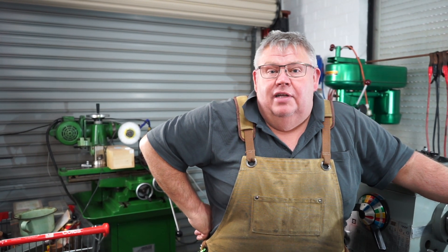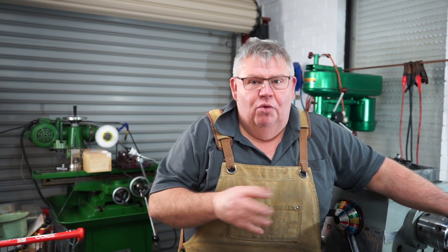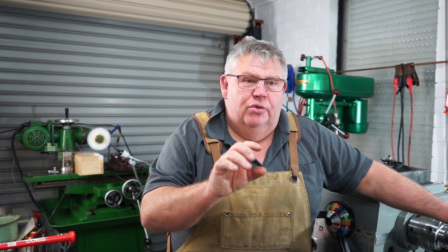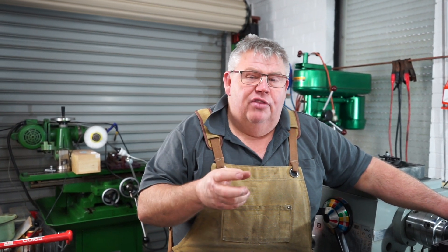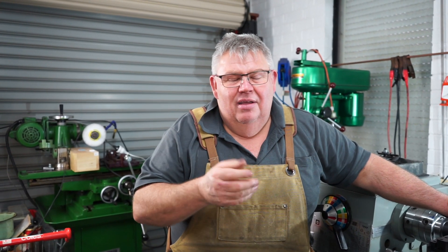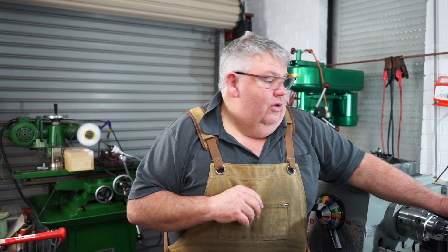Well, there we have it. Thanks for following along today on my Coventry die journey. It worked really, really well. And like I said, it's the first time I've ever seen one, first time I've ever used one, so I'm just wrapped. I came out here early in the morning and pulled it all apart — it was seized — got it working, so I'm glad that it worked. You can actually see it takes quite a bit of force for that Coventry die head to disengage. So you can only imagine with fine threads on probably brass and aluminium that you could run the risk of stripping that. That's quite a big head and I don't think you'd recommend doing smaller parts — you'd have to drop down to a smaller size Coventry head. See you on the next video. Thanks a lot. Bye-bye.